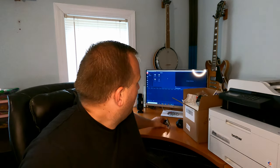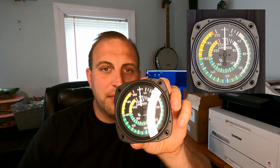Since we were taking the panel apart for the AV-30, what we found was my airspeed indicator from 1959 — the housing was actually cracked. So the people at Aircraft Quality Instruments, I called them up, they customized an airspeed indicator, actually rebuilt one, customized it to my color pattern for the airspeed gauge, and sent that up. I've got to run down and put this in the plane with the mechanic later today.